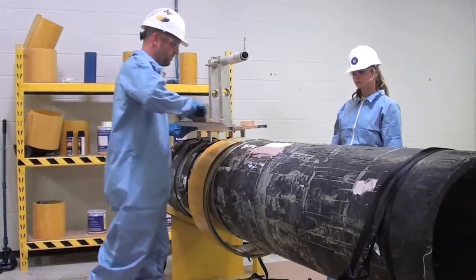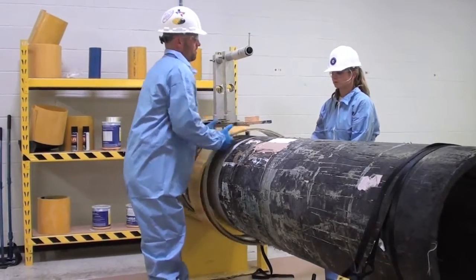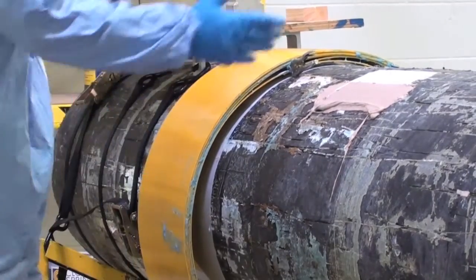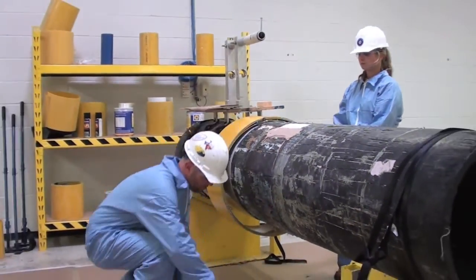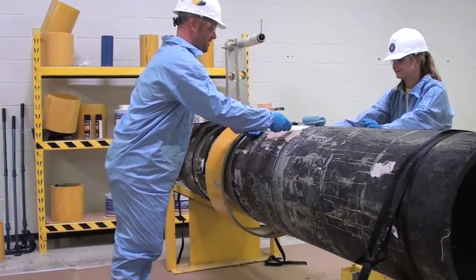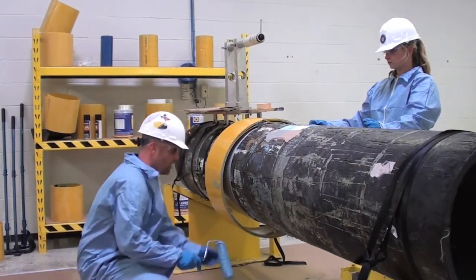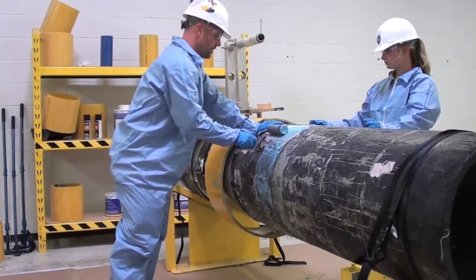One thing to watch while doing a spool feeder is the direction your coil is going. The reason we put the 4-inch vise grips at the edge of the clock spring is so we can see where we're going to have to line that up with the starter pad itself. We've now put our filler material on the leading edge of the starter pad and our next step will be to prepare the repair area. Always remember to watch the lip of your starter pad — make sure you don't get adhesive on the starter pad itself and always paint it in a downward position.